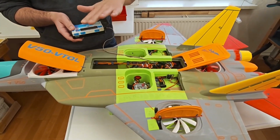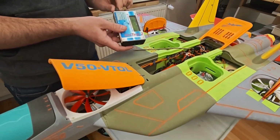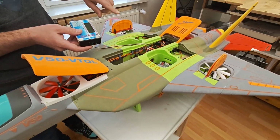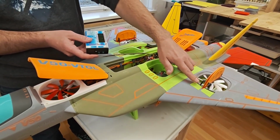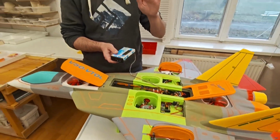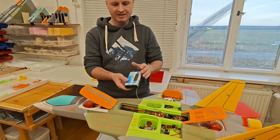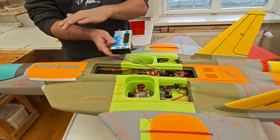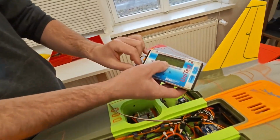And before you connect any channel to the flight controller, make sure that it works correctly. Later on, all these settings that the doors close correctly, you do with these pan heads, with these ball heads. This is done manually. We got a fixed output on the flight controller. So before you connect anything, use your servo tester and run them manually, so that everything opens and closes correctly. Also check the current. That's also important.